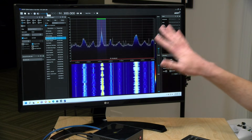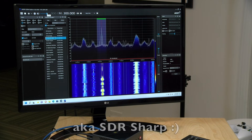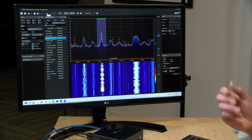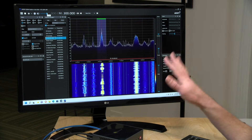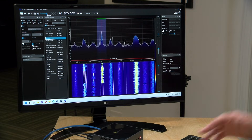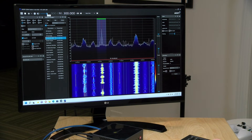The software they suggest on the Windows side is a free piece of software called SDR# and this software is your radio essentially — it connects up with the signals coming out of the USB dongle. There are a number of other software-defined radio packages out there; some are commercial and cost money, others are open source. This one is closed source but free, and I found it to be the easiest one to work with so far.